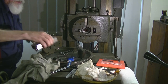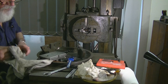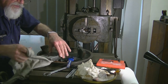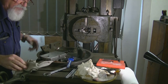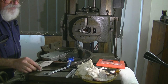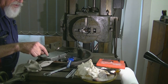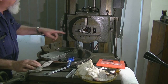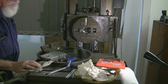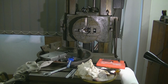I did try scraping around the inside of the hole — I thought I removed a bit of debris from in there. Might have just been a little piece of swarf down the hole. But it's still not finished. There's a section that looks like it might have been reamed after it was drilled, and there's a step in there. That step is just not deep enough to hold the pinion. This will be a careful bit of machining — I can't go too far, otherwise I'll have to put a shim. Back next week to see what we've done.